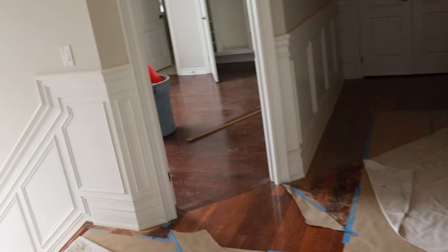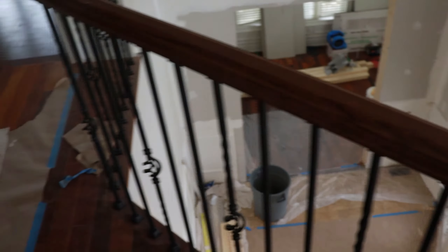Alrighty guys, so we are done for today. As you can see, we installed the shoe mold in all the rooms — shoe mold all the way around, and also in this room here. Now in terms of the closets, because I haven't dropped these yet, I only did up to the corner because I want to just butt into there, so I'm going to wait until I drop that before I do these pieces. As you can see at the end here, I had to learn how to do this little end cap because it kind of looked ugly without it — that's how it's supposed to look there. It was a little hard to learn but I got it down now, and all the corners have that.